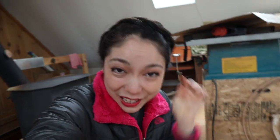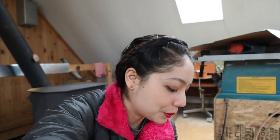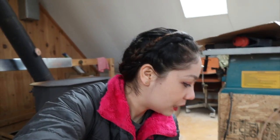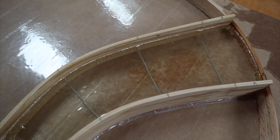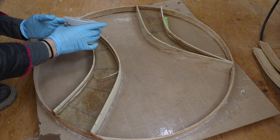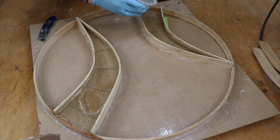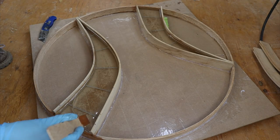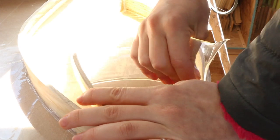It's the next morning and I came back into the shop to look at the epoxy. After we poured last night we lit a fire so that it would stay warm in the workshop, but when we came back an hour later the shop had somehow hit 90 degrees. So it appears that the epoxy has overheated — it's really not ideal because this is supposed to be crystal clear, and it appears that it's yellowed slightly. The exothermic reaction caused a little bit of rippling on the top as well as some bubbles on the edges, but mostly it caused shrinkage which pulled the epoxy in from the edges. So I just took a little bit more clear epoxy, poured it on top, filled in the gaps, and it looks great.